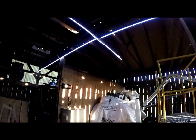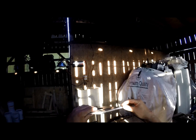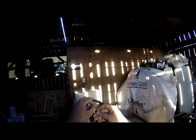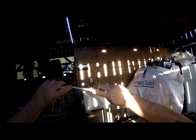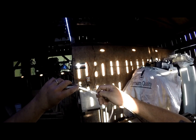This will provide us with plenty of light. These LEDs will burn for about nine days straight on one charge of the battery. These are the LED strip lights I've used — the weatherproof style. They have one power end on them, and there are videos on how to add more ends. You can cut this about every third light — see that little copper space — and put splicers on there to rejoin them.